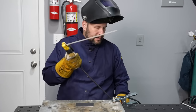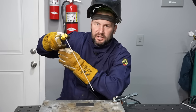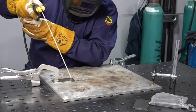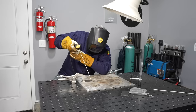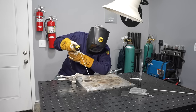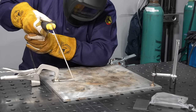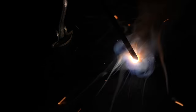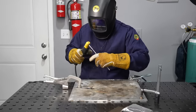I'm going to put my electrode in the holder and prop myself up to support and triangulate, so I'm not wobbling around. Striking an arc looks easy when you're watching someone else do it, but this can be one of the most frustrating things in your welding journey. If your electrode sticks, it's probably because you're putting it down too hard or your amperage setting is a little too low — you most likely just need a bit of practice. If it gets stuck, wiggle it to break it loose, or release the electrode holder. Practice striking an arc over and over again: strike, weld for a short length, then do it again until you're feeling good.